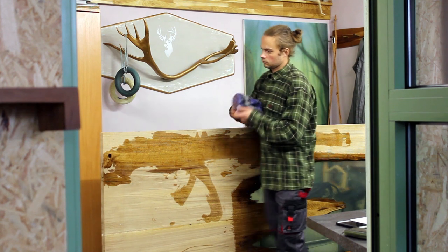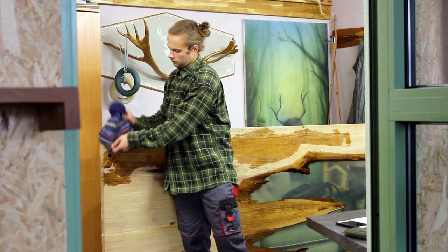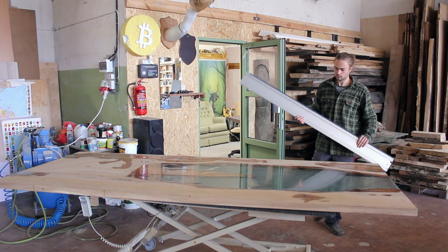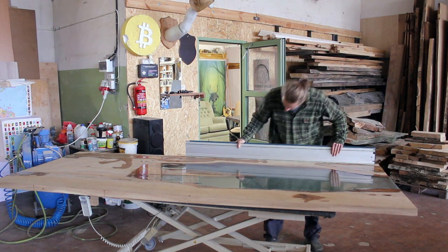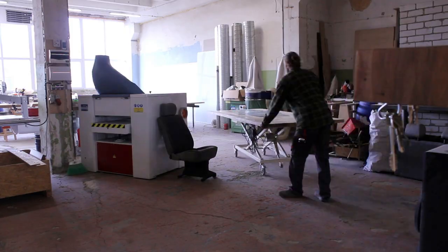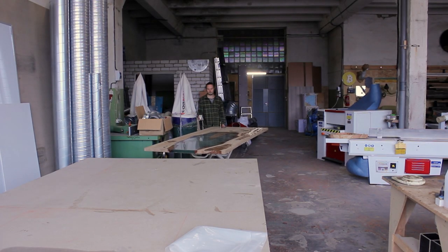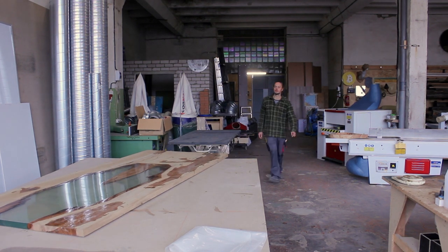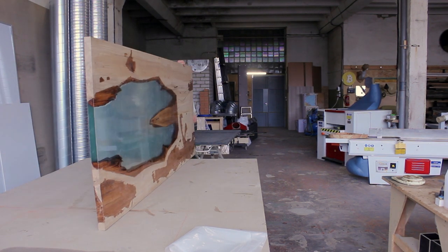In the last episode of this build I took it from the flatbed into my office simply because it was getting too cold in the workshop. But it caused a bit of a problem — the last third of the table bent down because of the residual inner stress in the slabs, and the epoxy hadn't acquired its full strength by the time it was demolded.